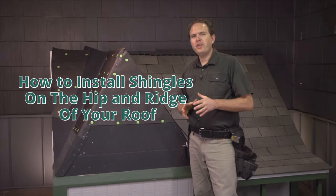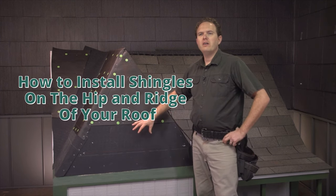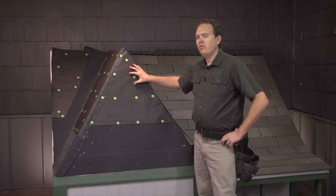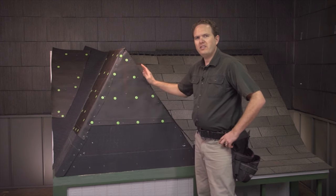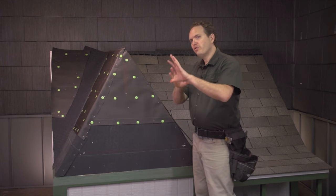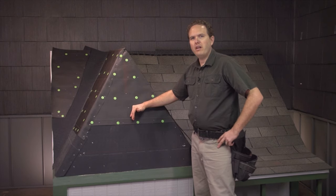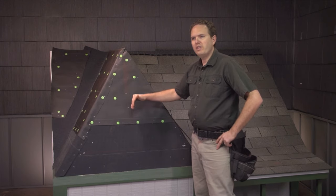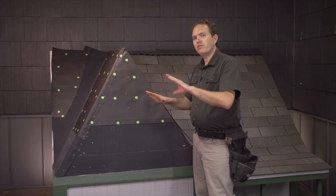I'm going to do a quick section on some special considerations when you're roofing a hip section of roof like this. This is the end of the hip — you've got two slanted ends. You don't have a nice squared-off gable end from which you could start your pattern and run your shingles up and over on. So to roof an area like this, you have to create a reference line that's going to be your straight line or gable end, and then use that to roof off in either direction.